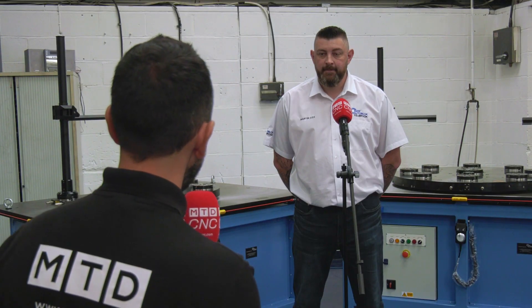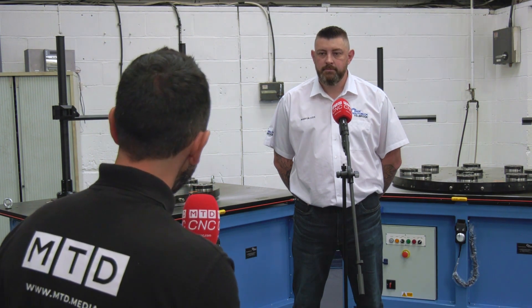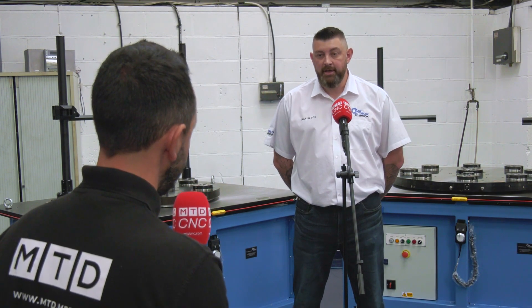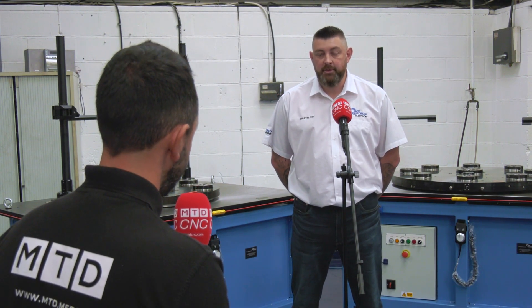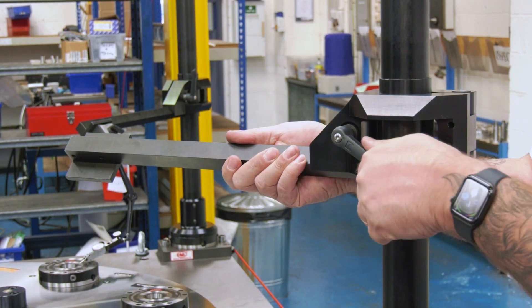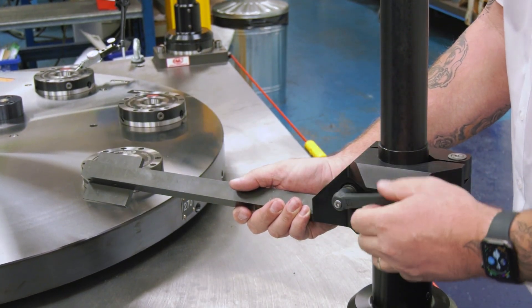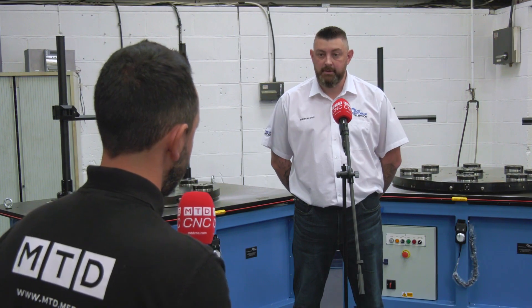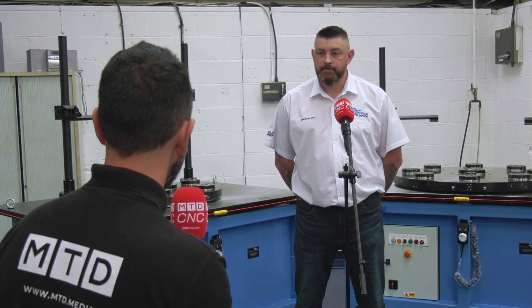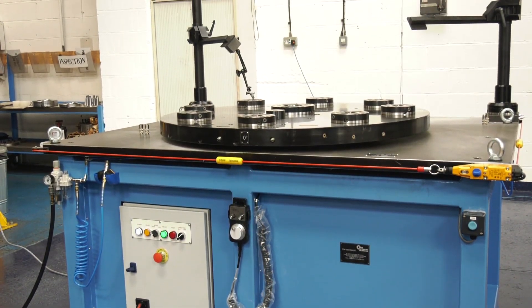When you're clocking in the components, how do the setting arms work? They're manually adjustable in height so you can use a clock and a stand. They attach and detach using an additional APS module for quick removability, and they're mounted to the setting table with a zero point fixture — which is pneumatic.